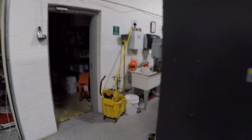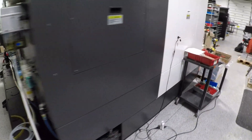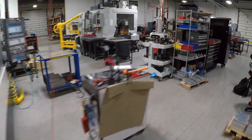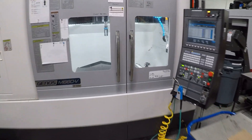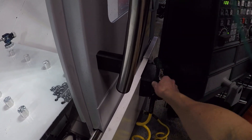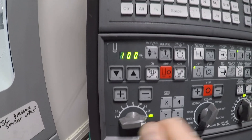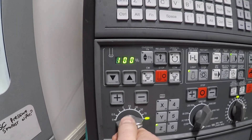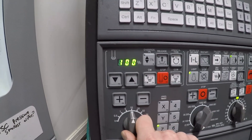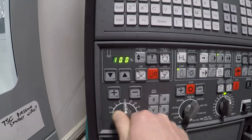I really like that this machine has separate pumps for all the different systems. There's a separate pump for the through-spindle coolant, which is pretty normal, but what I like is having three separate pumps for the hose, wash down, and regular flood coolant. That means using one doesn't come at the expense of flow or volume from another. You've got adjustable wash-down bars on the side enclosure, regular flood, and a wash-down gun. We also 3D printed a little part to hold our air gun. The override buttons are another really nice feature — they go from 100 to 50 to 10, then 5, 1, half a percent, and zero, giving you fine control before going back up to full speed.